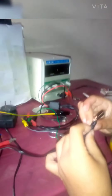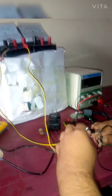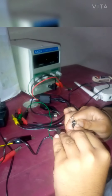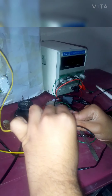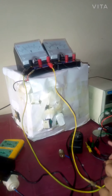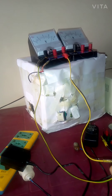I know I did not do it in a very tidy way because the wires are not close enough and are left exposed for possible short circuit. Now I can measure the output voltage. The two pins are very close so I need to be careful to avoid a short. Now measuring: the input side reads 12.5V and the output is 9V.